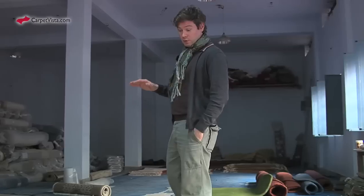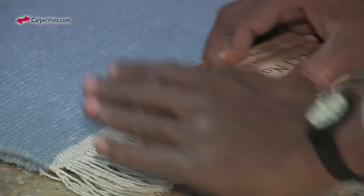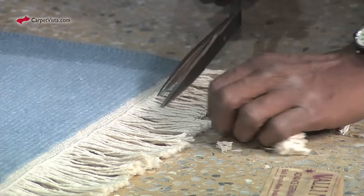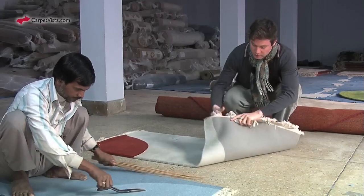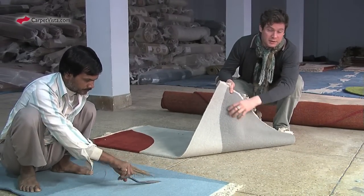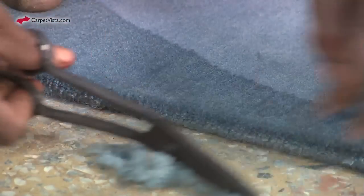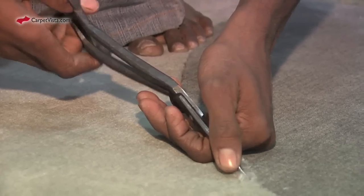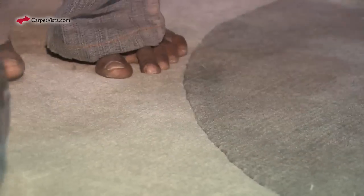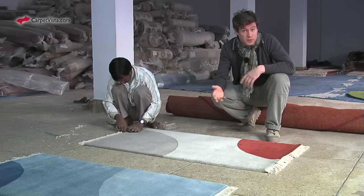This is the final step in the process of manufacturing a carpet. One could refer to it as the finishing or the fine-tuning. All unevenness is trimmed from the carpet. If there's any uneven threads sticking up here and there, or if the warp thread sometimes can appear on the back in white, they are then pressed back and in. The edges are trimmed properly, and in certain cases a relief is even cut. After that, the carpet is ready for further sales and export.